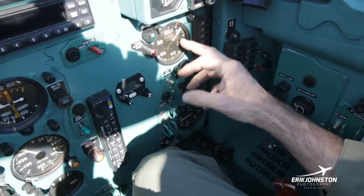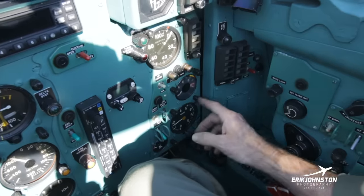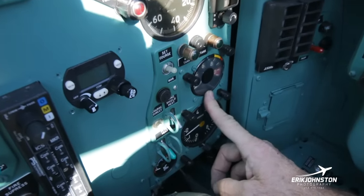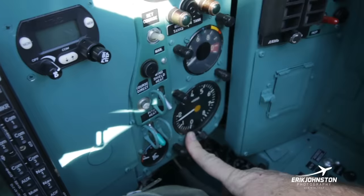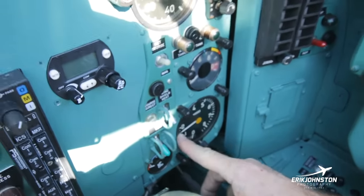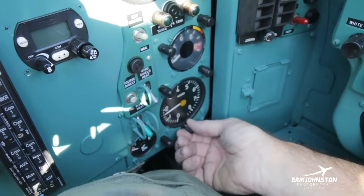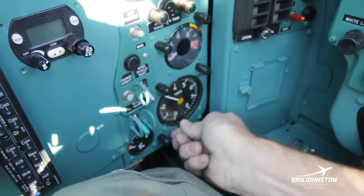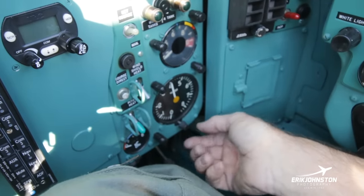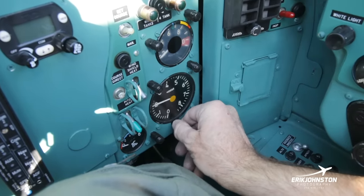You have a high pressure turbine gauge and low pressure turbine gauge in this. The number two needle is actually hiding behind it. Exhaust gas temperature gauge, good indication of how well your engine performance is. And this is a fuel gauge that we talked about. So right now, I have about 1,600 liters of fuel in it. And if I filled it up, I would just adjust the gauge to 4,000. And as the engine would run, it would subtract what it thinks it used, and you would see the gauge start to come down.